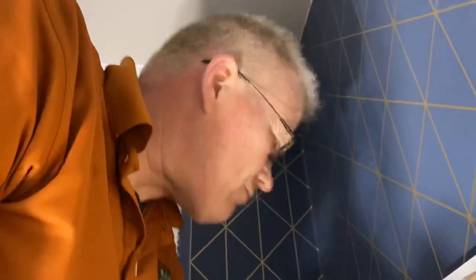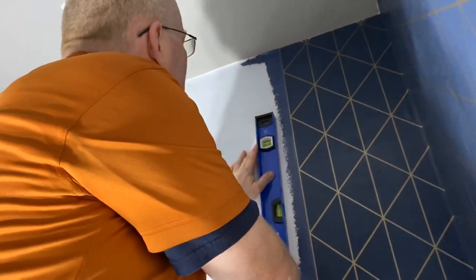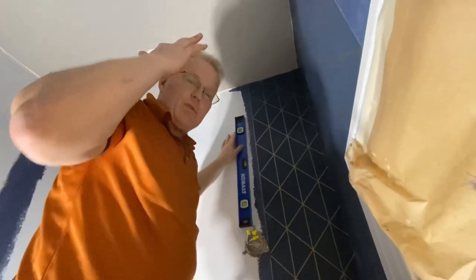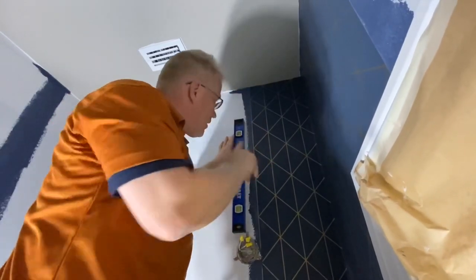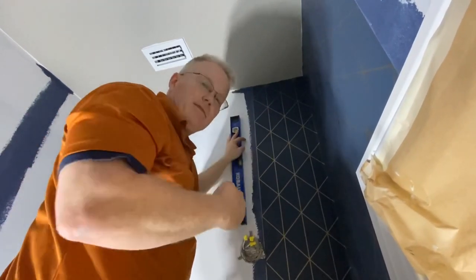Don't cut your corners on this type of material. If you're a wallpaper hanger, you always want to hit a home run. Don't hang anything that's going to make your work look bad. If somebody wants this hung in corners that are significantly off plumb, my suggestion is to have them get somebody else to hang it — because this is a reflection on your name. I suggest you don't do it. This is how I operate.